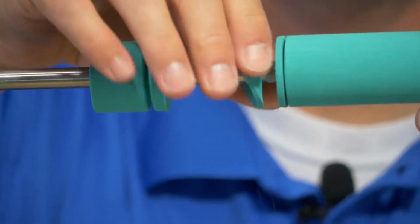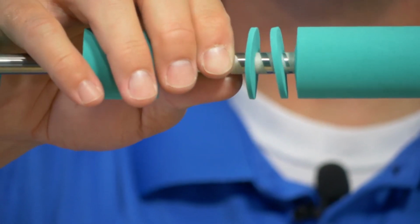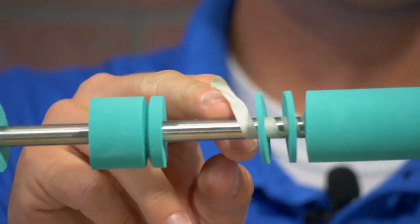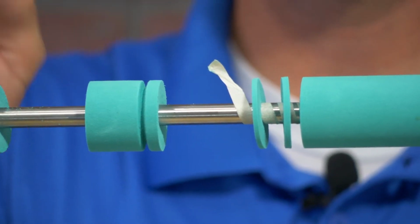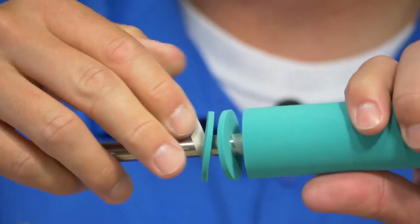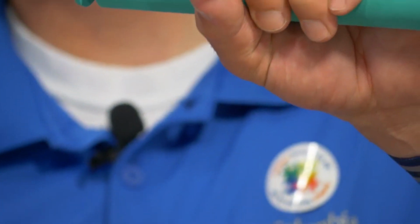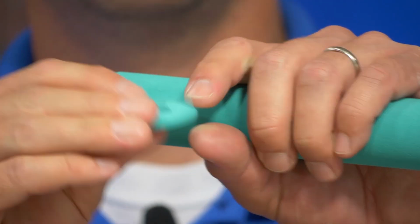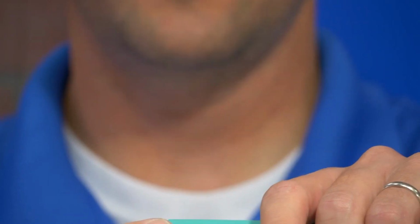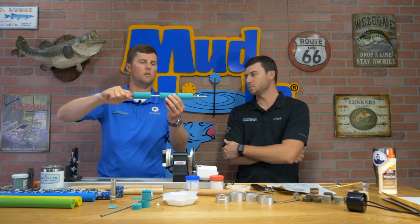Other rings here. And you'll notice under this, can you see that tape on that mandrel, Nick? So there's tape underneath this EVA. Sometimes when you get your mandrel, especially if it's been waxed, like it should be, before you start turning grips on it, this EVA will spin on this mandrel, okay? So sometimes you've got to lay a bead of tape down, that's probably 1/8 of an inch thick. So you can do little tiny discs, and those are perfect when you cut it with thread like that. So we've got little discs, we've got bigger sections, we've got sections like that.